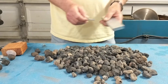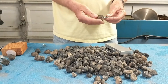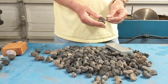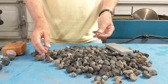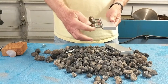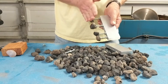You take your rock, put a drop of crazy glue on it, flatten out one surface of your rock, and glue it right to the fixture. Hit it with some accelerator and it'll set up. I've actually never had any come off, which surprises me. The main thing you want to do is keep the same distance between your flat bar and the bolt head so they all line up, so when you cut you can get the most out of your cut.